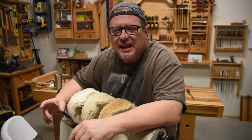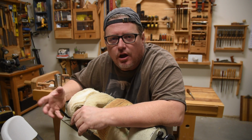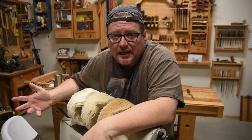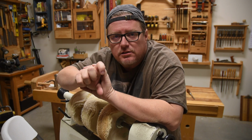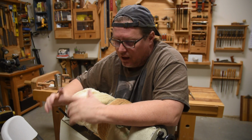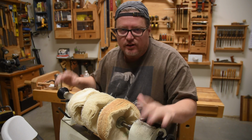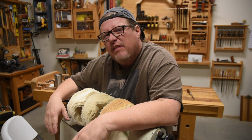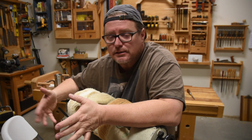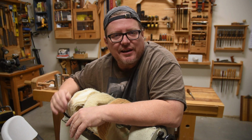Buffing is just a very inexpensive way to take your product to the next level, to give it an ultimate finish so that when the customers hold it, they can really appreciate your work. And it really is inexpensive. You can buy these kind of setups so that they'll set on a little hand drill or even a car buffer if you're doing big cabinet pieces. Any kind of buffing will work. This is just one option, this Beall setup, and I like it because I can just leave it on this lathe and just touch stuff up as I go along. And every few months I'll have to go through and redo all of the stuff in my show setup, the stuff I'm selling that hasn't moved yet, and it's amazing. It just kind of brings that last little sparkle up and it makes the stuff a lot more attractive to buyers.